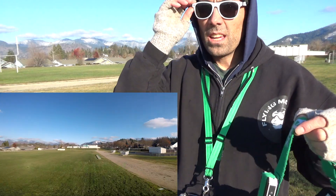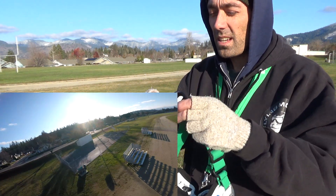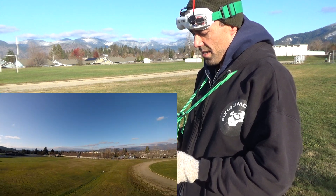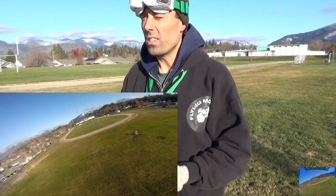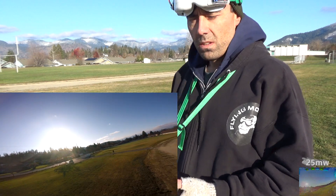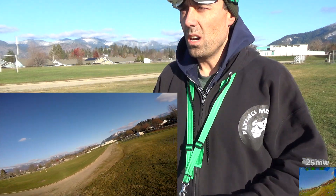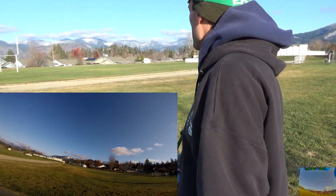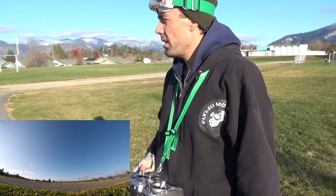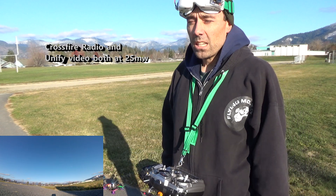My glasses from West Coast Throwdown. Before I turn on the quad, I'm going to put my radio — because I've been on the bench — bench settings at 10 milliwatts, so we're going to turn that up to 25. That's what I like to do on field testing like this because you shouldn't need more than that out here. We're in a nice big field, this is a middle school close to where I live. At events you have to be at 25 milliwatts, so that's where I like to test. It's also a good test for your antennas — checking my RSSI and link quality, making sure everything at 25 milliwatts is just fine.